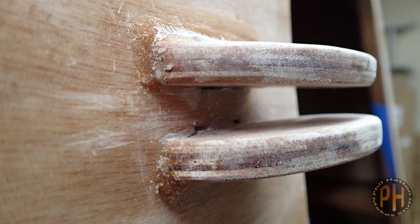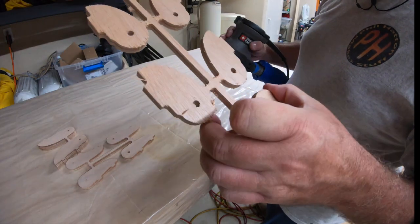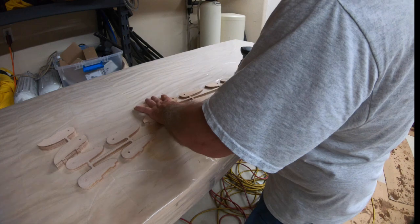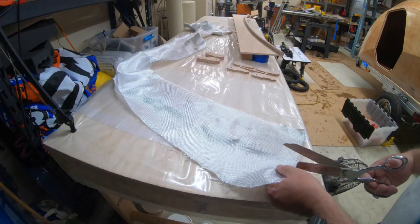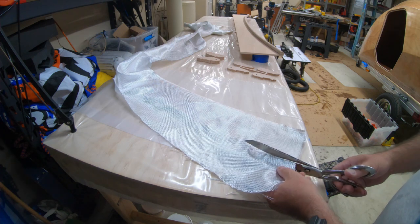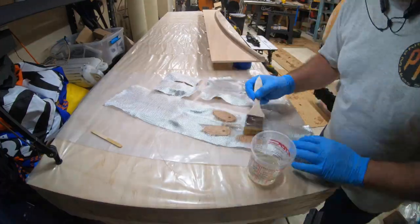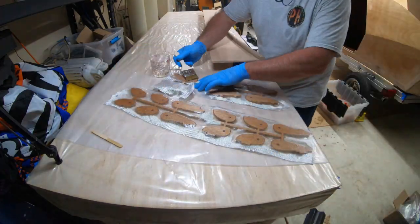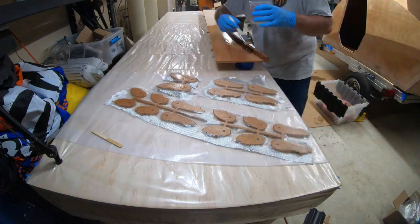The wooden hinges are a nice detail, but they can be a bit fiddly. You want to be sure that you've installed them so they line up and pivot without binding, so they need to stick out 90 degrees from the side of the camper for the doors, and straight up and down on the top of the camper for the galley hatch, not 90 degrees to the curved top of the camper. You also want to round off the edges of the hinges a bit because sharp edges sticking out are the sort of things that wear and get chipped. Rounded edges aren't as susceptible to damage.